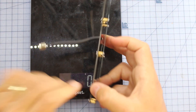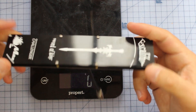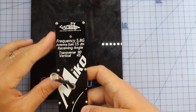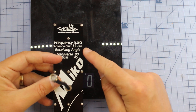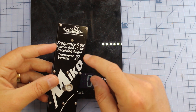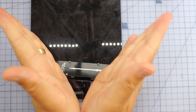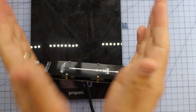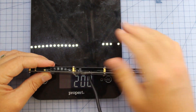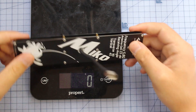Something I don't like: you can see direct solder on the back, so if you're trying to move this around I can see that possibly snapping. A much better solution is to have a little connector at the back like on the triple feed. Now if the weight doesn't bother you, maybe you're going to be mounting this to a ground station. Looking at the stats written on the back: it's on the 5.8 GHz system, it's got 15 dB of gain, and its beam angle is 90 degrees horizontal by 45 degrees vertical.